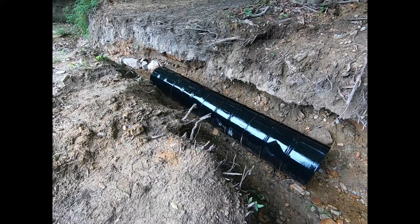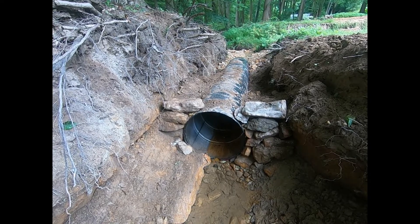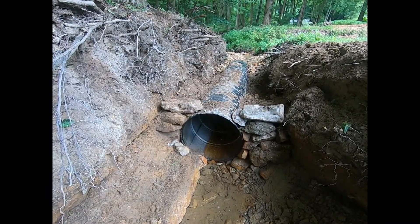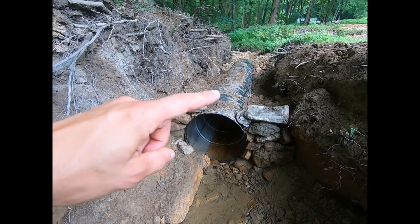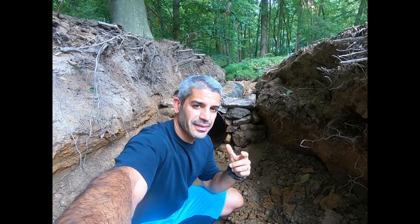It's all painted and ready to go. I'm going to let the paint dry and then start filling in the area around it. I got those big rocks at the entrance of the culvert. They recommend at least half the diameter in coverage — this is two feet, so I need to go at least a foot, actually almost two feet here. A word of caution: these are steel drums, so they will possibly corrode. I did paint mine but did not paint the interior. They do have corrugated pipes which are a lot more expensive — that's the reason I did this with steel drums.